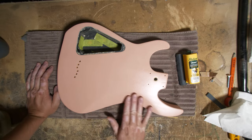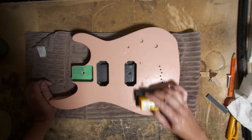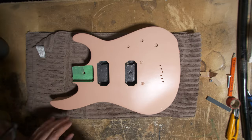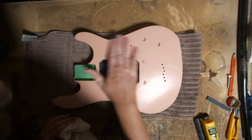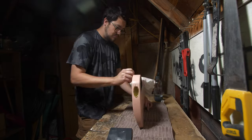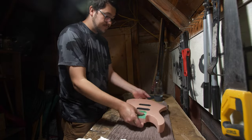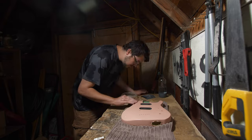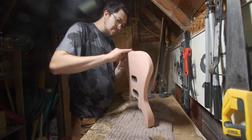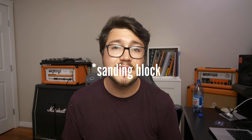After that pass, it feels really nice and smooth. We're sanding the top to 800 grit, and at this stage my biggest fear is sanding through the finish, so I was really cautious — I probably didn't sand enough at 800 grit before going up to 1000 and higher. If you're doing a similar project, make sure the surface is flat by holding it up to a light and looking at the reflection. My next step is to bring it up to 1000 grit; it's about the same process, just a little bit finer. I decided to hand sand at this point for a more delicate touch compared to using the block sander.